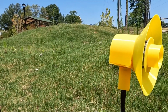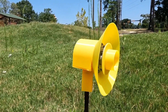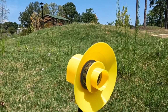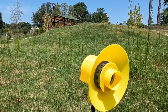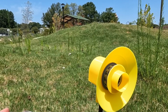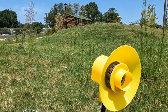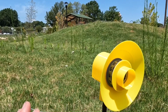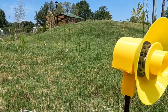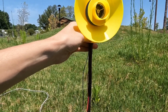So this rotator is a gear-driven rotator with its own independent motor, as I stated previously. What that leads it to do is that if you were to run this in attack, for example, as soon as the siren has power cut to it, it will begin winding down, but the motor almost stops immediately. So it's not like the actual 500 SHTTs or even the 500 ATs and the 500 series that Federal put out, where if you cut power to them, the fact that the rotor is still winding down will oftentimes carry the siren around still because of the way that the rotator functions on those. But because of this design that I implemented, it just doesn't do that. So that's just one thing to consider.